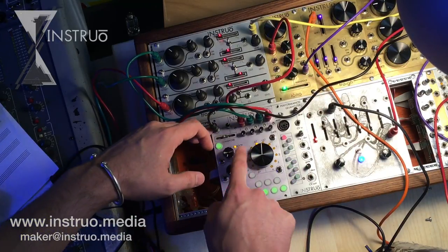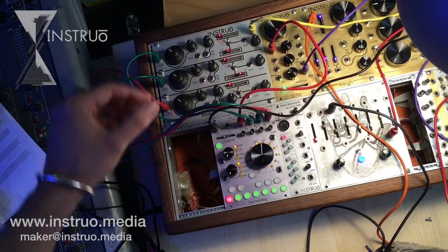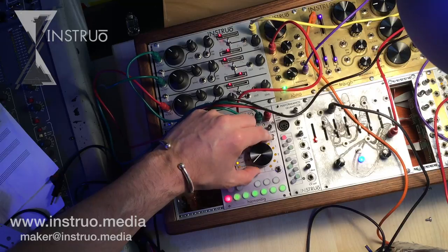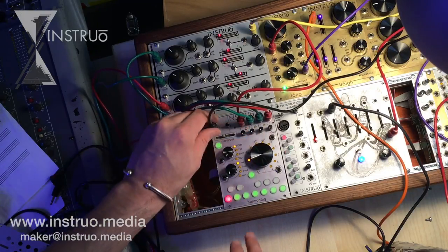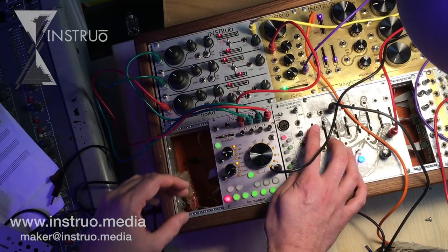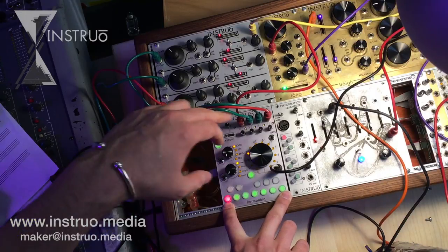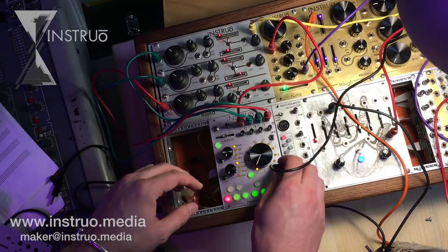So, as you can see, the chord quality is automatically changing with the voltage. So the knob doesn't do anything by default. To enable that, you punch in the button and then the knob overrides, and you have manual control over what the chord quality is. That can also be sequenced. So if you had a duophonic sequencer, for instance, you could be sequencing the root of your chord progression as well as the chord quality to get really unique custom voicings.